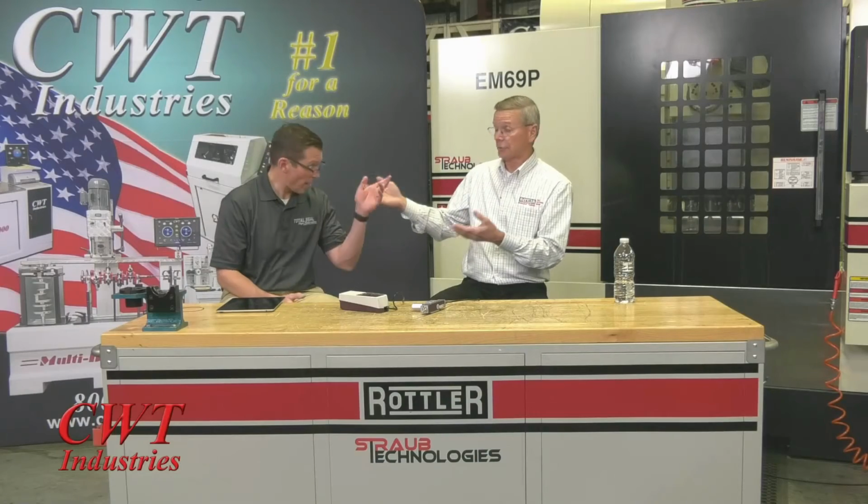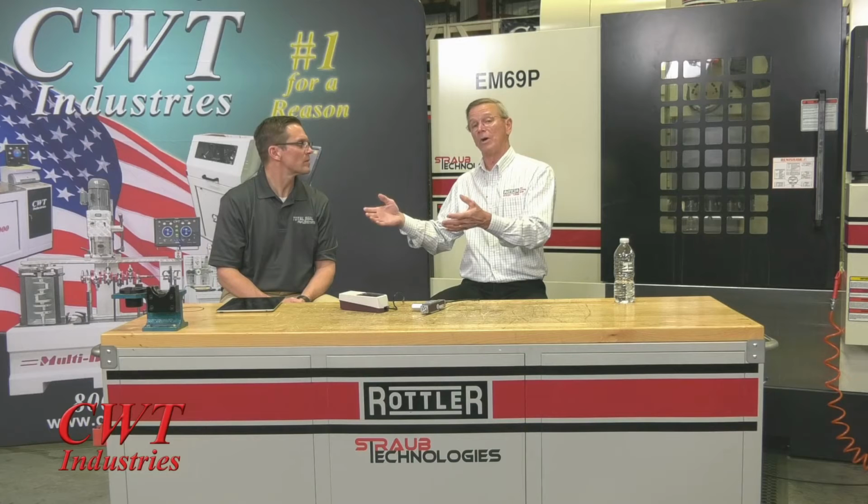And there's always been a misconception with the 600 grit: the more you hone, the slicker your RPK is going to get. But that's not the case. That's why we use the 600 grit CBN, because it gets us in that RPK range that the ring manufacturer really wants to see.